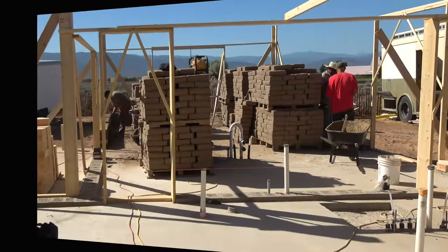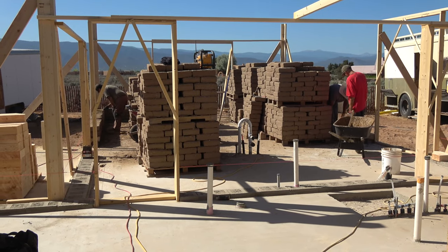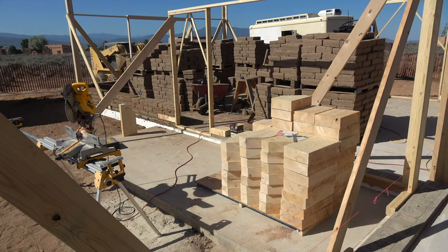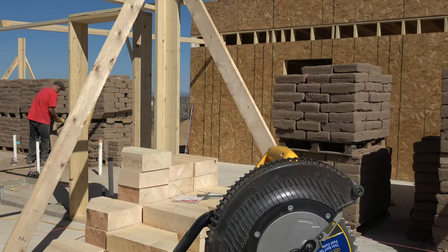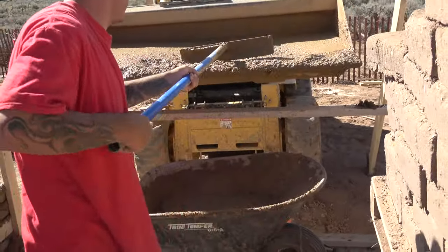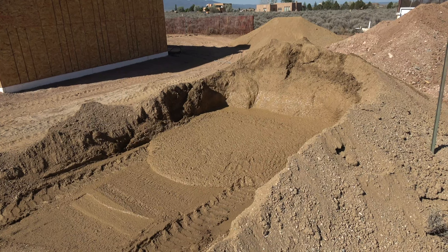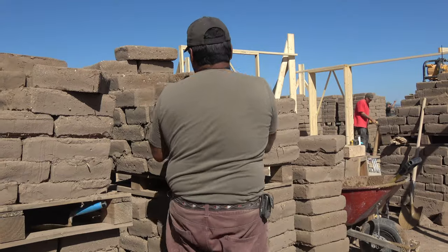Before the first Adobe brick is laid, we first have some preparation to do. We first stock all of our pallets of adobes on the interior on top of the slab. We have to place our corner posts, door frames and run our string lines. The Adobe bricks are laid in mud mortar — it's actually crusher fines that we use, and we mix them in the pile that the dump truck leaves them in with our Bobcat. That way we can get a lot of mud right away.